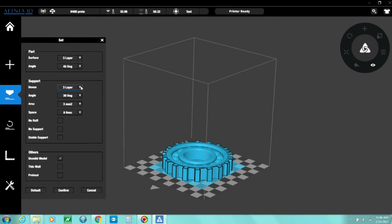If you have, again, printing in thinner layers, you may want to print in a thicker raft. It will make it maybe a little stiffer, which might make it a little easier to remove off the object, especially in deep wells. Consider if you do add more layers that it will take longer to print.